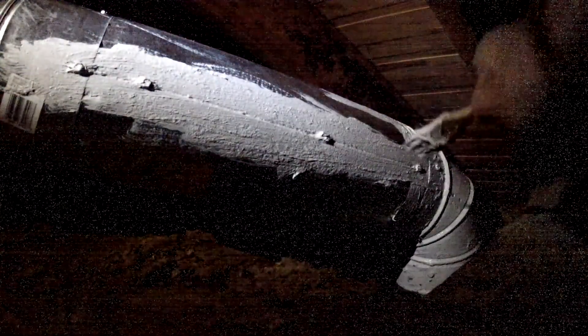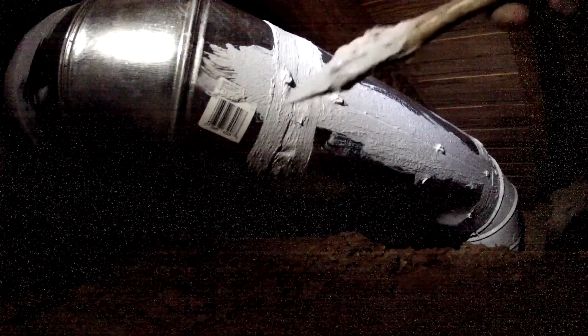This is a six-inch galvanized duct. The seam where the duct comes together and snaps together — you want to make sure you mastic that. You want to mastic anywhere that you have a screw coming through the sheet metal, anywhere that there's a joint. This is a pretty thick product and it goes on easy with just a cheap little brush — we picked up a whole big pack of them at a big box store for a dollar. I do wash this brush out when I'm done; this stuff is water soluble, and I'm still using the same brush on several ductwork lines.